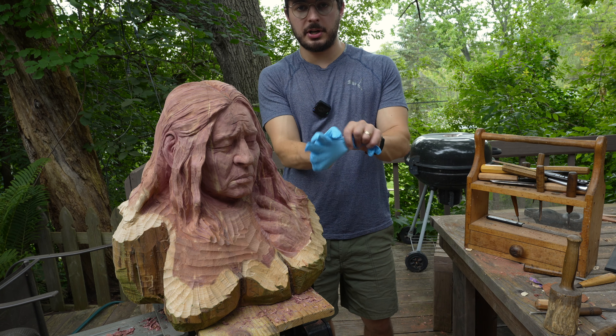I'm going to use a thin coat protective finish of tung oil, which is a really durable oil-based finish that is just excellent for this type of work. I've got some thinner. I'm going to get my air hose and blow this off quickly. I'm also going to use the chisel to clear out some of the bark that's hanging out in these crevices.